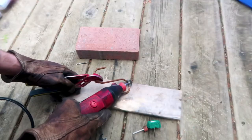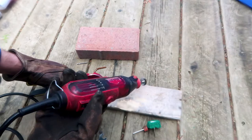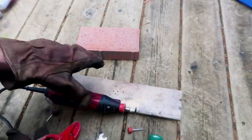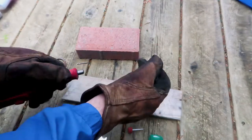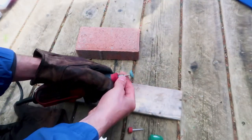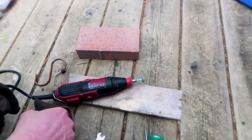Here I'm using a wire brush and removing rust from a hook. I can adjust the speed. Now I disconnect and use the pliers — lock the nut in place, undo the nut, throw the bit down and stick another bit in. It's real easy to do this quickly. Now it's in place, locked — there's usually a snapping sound — then use the pliers to tighten, reconnect the power source, put the gloves on, and I'm ready to work.